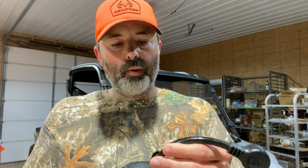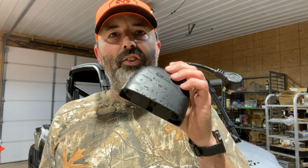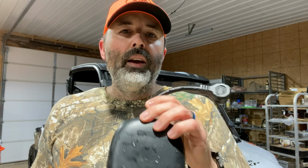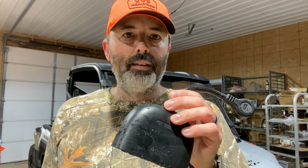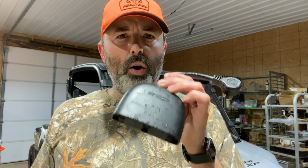But also, just because you can stretch this to 150 feet on an extension cord does not mean you can pull 15 amps through it. You're going to burn something up. With a 12 gauge extension cord, I think at 100 feet, you'd have to look at the chart. The further you get, the fewer amps you can draw through it without overheating whatever's plugged into the wall, or the voltage drop across the appliance can cause damage too. There's a lot of variables that come into play.